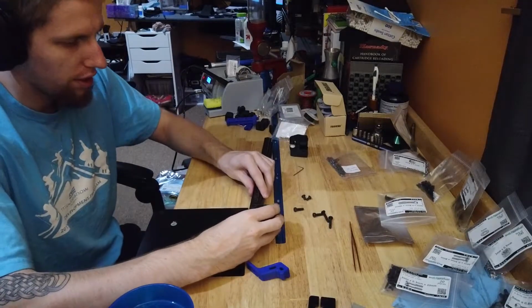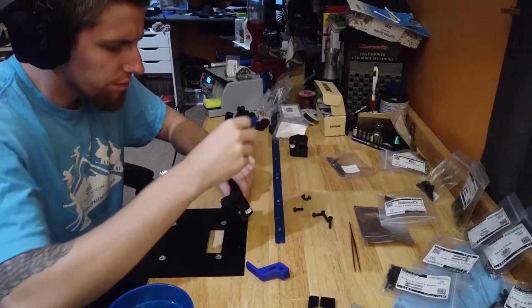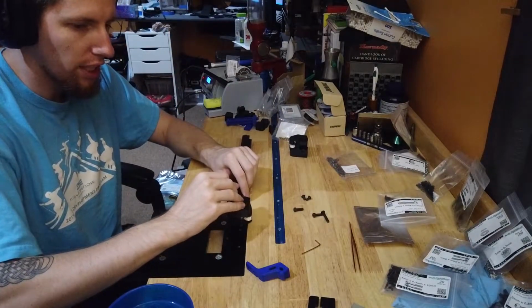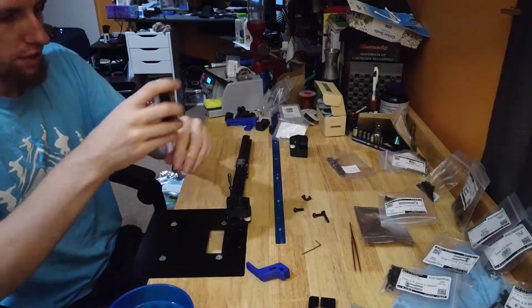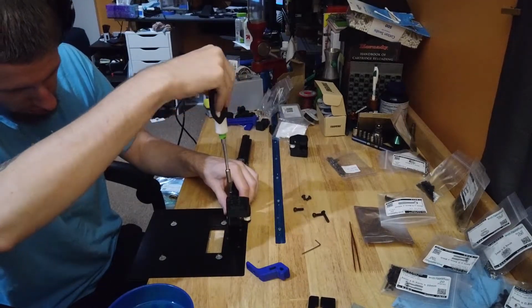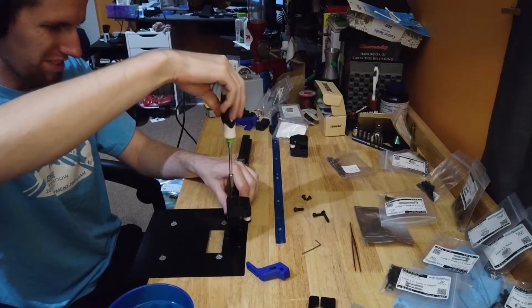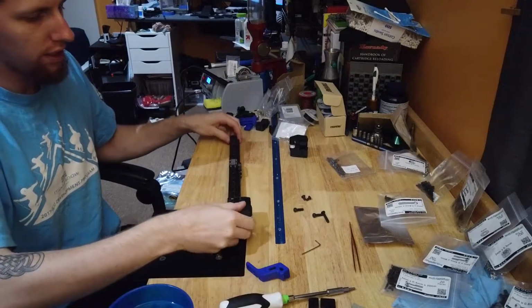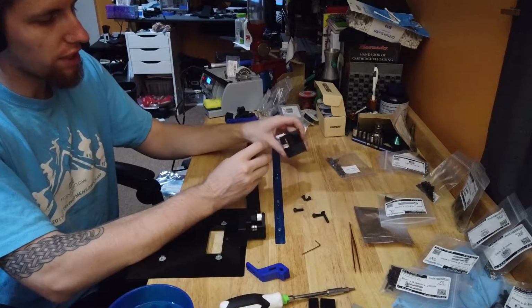Okay. Slot it in. Realize we got it close, but not quite. Scooch it over. Take your M5 by 30, and we're going to run those down first. Now there are 2 sets of notches, one on the bottom, one on the front here. That's where the rails need to sit.